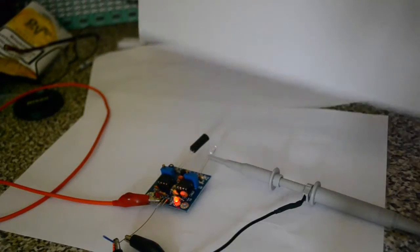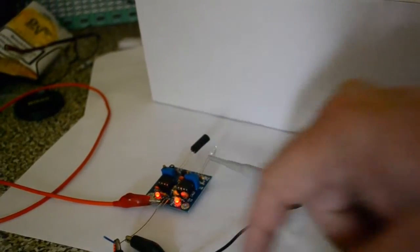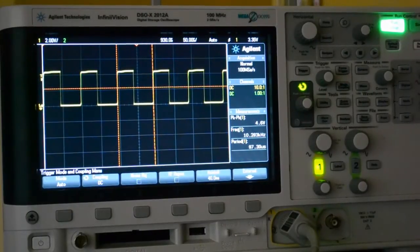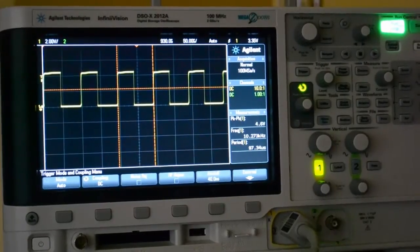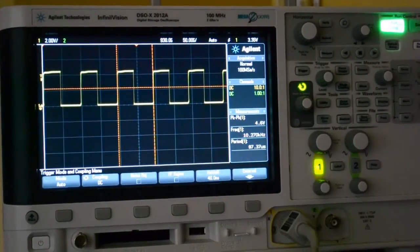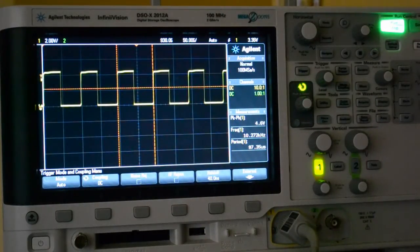And it works quite well. I've got the scope set up on the transmitter at the moment, just to show you what they're doing with the transmitter circuit. So that's the transmitter — I've turned the pot down anti-clockwise, so it hovers around 10 kilohertz. That gives a nice amount of sensitivity. If it's too high, the sensitivity becomes too sensitive — it will even stop working. So if your board's not working, turn that transmitter pot all the way down anti-clockwise, so you start at a low frequency and then work up. Mess about with the settings to get the sensitivity you're after.